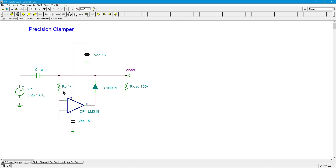Before we get into the analysis, I have to point out one thing. Typically when we look at linear op-amp circuits, we have two rules: first, the input current is negligible; second, the differential voltage is zero. That's true if it's operating in linear mode. This op-amp is not — it will not be operating in a normal closed-loop linear fashion the vast majority of the time. Most of the time this is actually going to be operating in an open-loop situation, so the voltage between the two inputs can be huge.